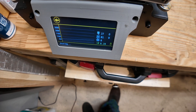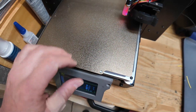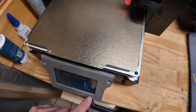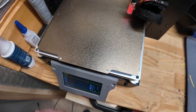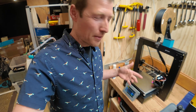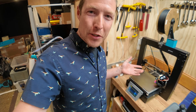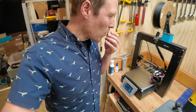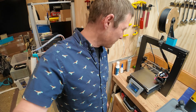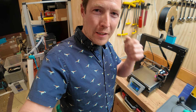I'm heating my bed up to 100°C to do the PID calibration. One thing I need to look out for is the magnet that holds the steel sheet — it might demagnetize above 75°C. At 83°C it's getting a little less strong but seems fine. It actually hit 100°C with its 8-year-old heater and still has magnetic properties — big win.